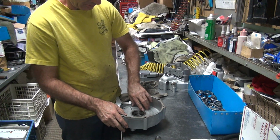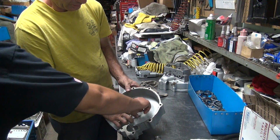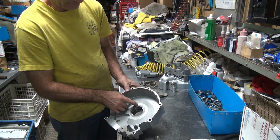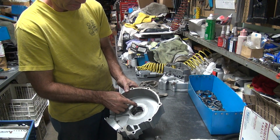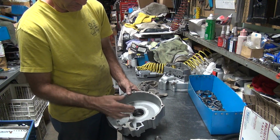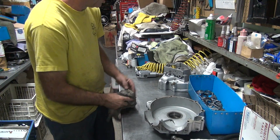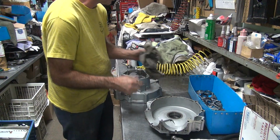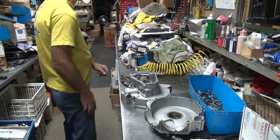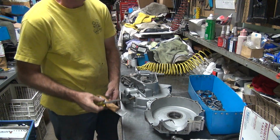So yours seems to be holding the position it's in. It's not really changing. How does it move? See, it's still smooth on this side and a little bit on the down. It's down only probably three or four thou there. It's the only difference you get. So at some point it has moved, but it's not like it's really loose. So it's acceptable. It is what it is. It's good to go for another motor overhaul, until it's not. It'll let you know what not is.